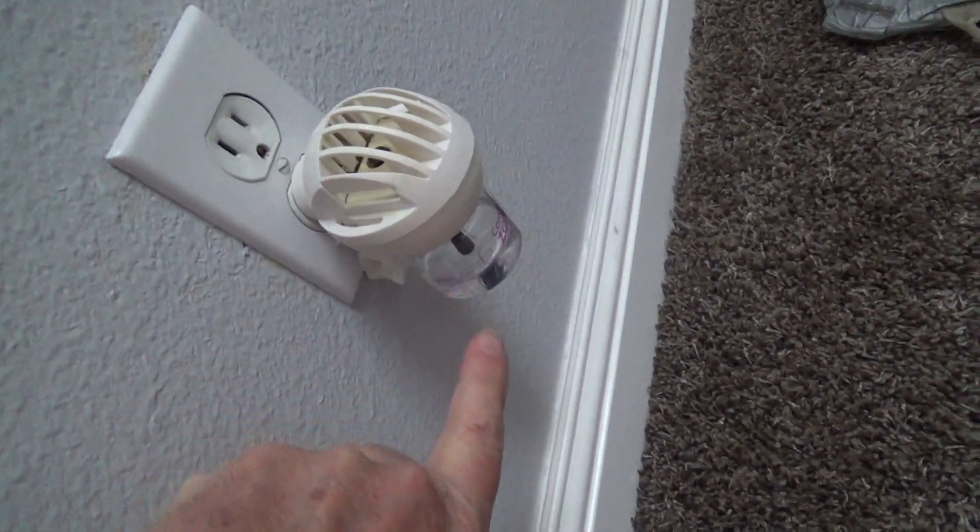Here's another thing to realize. This is a 15 amp, and I know that because it says 15A there and 15A over there. They let you run 15 amp electrical outlets on a 20 amp circuit — in this condo, all of the lower electrical outlets are 15 amp running on 20 amp circuits. I don't know why code lets you do that, because in the kitchen for 20 amp you should have 20 amp electrical outlets connected on a GFI breaker.